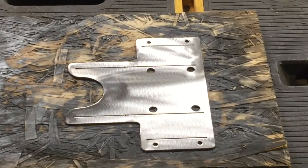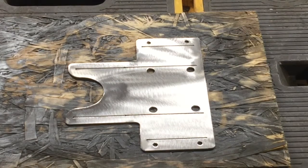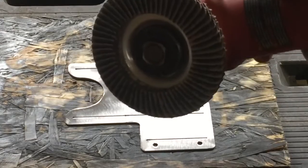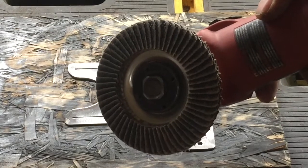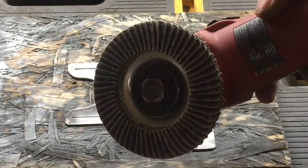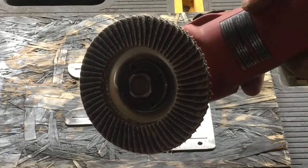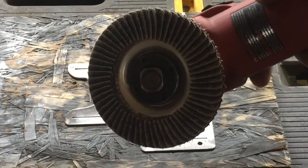The slag — what little slag there is on it — has been knocked off. I basically use just a flap wheel on a grinder. They have some give to them versus a hard stone, so you can feather stuff a lot nicer with this, and they last quite a while. They are expensive, but they last, so if you buy good ones it's worth it.